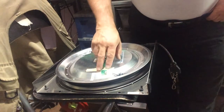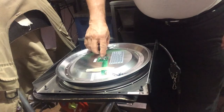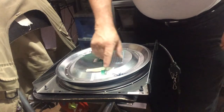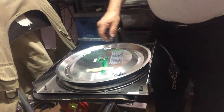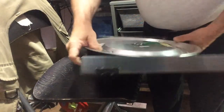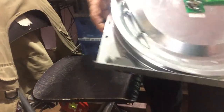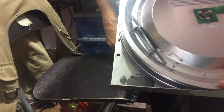This circuit board is very, very easy to work on — everything's exposed, I have plenty of room to work. I have solder pads where the wires go, and additional wire pads here. Replacing the cable is very easy. The backside looks like this — here's where the floor cable goes in and that's where the wires come out underneath the drum, connecting by a solder connection.